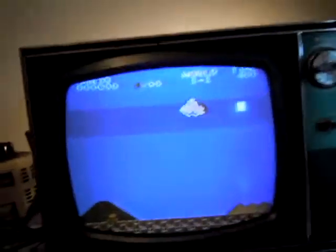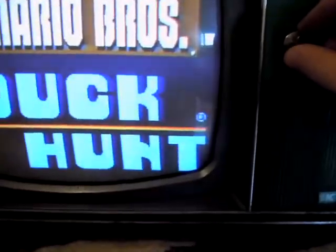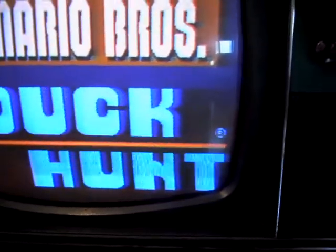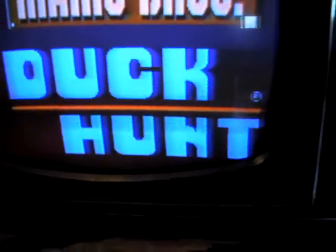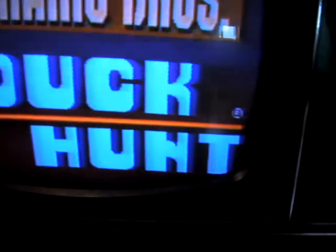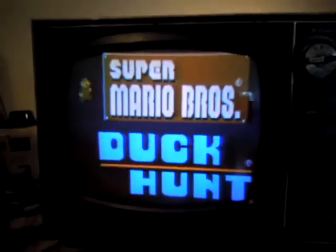If I just reset my Nintendo, you'll see the horrible color bleed. We crank up the chroma here, you can see how it kind of bleeds — we have blue coming off of red, and then we have this red haze down here along the blue. That's cheap demodulation. That's really just poor engineering.